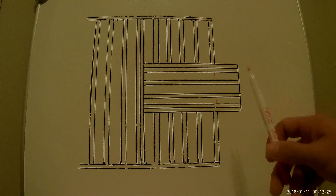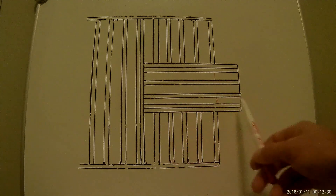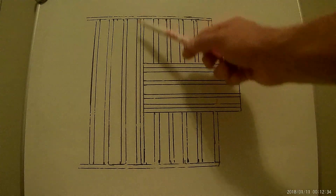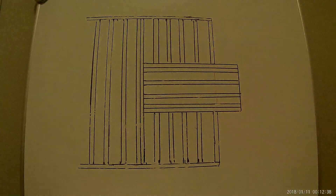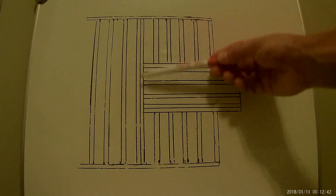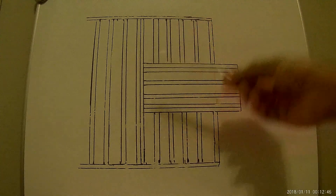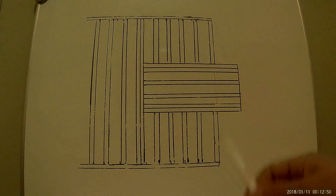So because we have no concrete, no foundation, we have to frame our cantilever so we have something to hold our walls. As you can see, we have these joists — they're called cantilever joists — running perpendicular to our main floor joists. And we have a double floor joist in this area.